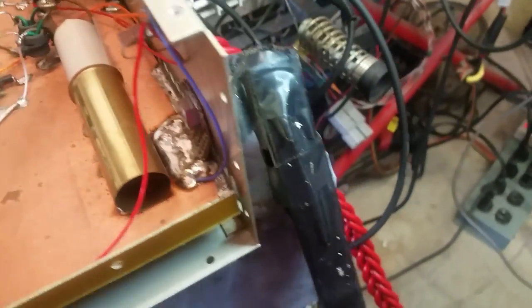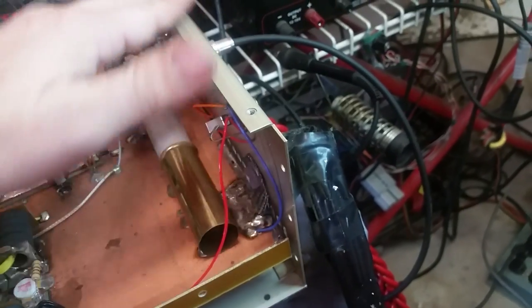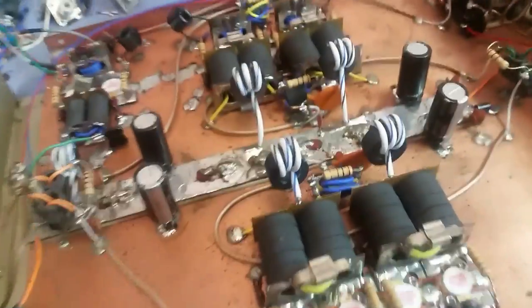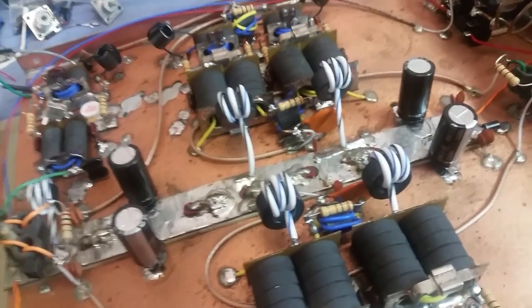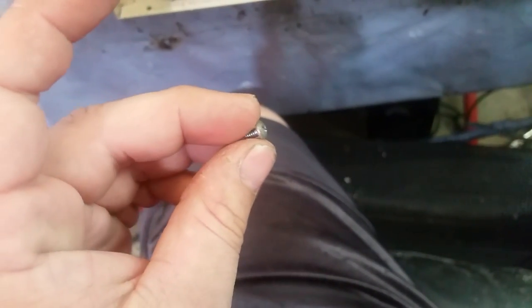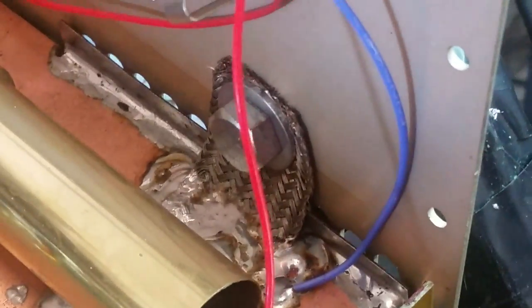I put a brand new stainless bolt on there for you. And originally, there wasn't a strap going to the board, which of course on these type of cases, you can just touch a continuity meter and get an electrical connection. So they're pretty much grounded through the sides right here. The only problem I have with that is, without using stainless hardware, let me see if I can show some examples here. The hardware over time can become oxidized, not giving a real good connection possibly, as you can see from the tip of that, it doesn't have that shine anymore. So I'm replacing all that with stainless hardware. I just went ahead and put a strap down there to be safe, which is what you asked for anyway.